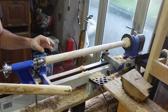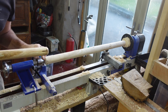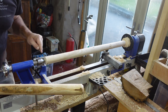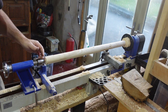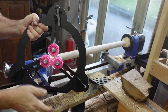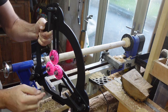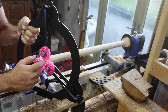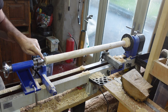What I want to do now is drill into here in order to put a fitting on to allow the sections to join together. Because it's on the lathe, it's nicely supported at that end, but as soon as I take this out it won't be as well supported. So what I'm going to use is a new toy called a stabilizer. This rests on the bed of the lathe, and you adjust it so that these roller-skate supports can turn while it's supported. I'm going to put this on and then drill the first hole going this way.